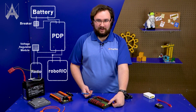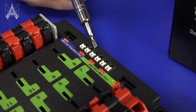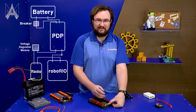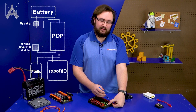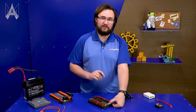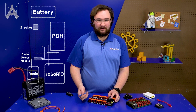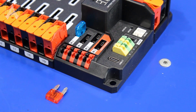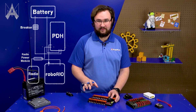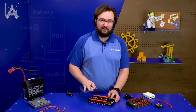With the Cross the Road Electronics Power Distribution Panel, the RoboRio connects to the VBAT controller power connector at the bottom of the board, which is protected by a 10 amp fuse. This fuse can come a little loose from vibrations, so before every match press it down and make sure it's really secure. The Rev Power Distribution Hub also uses blade fuses, which similarly can come loose after a couple matches — just press them down and make sure they are completely secure before your match.